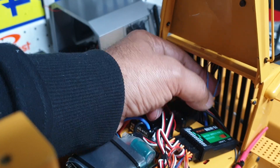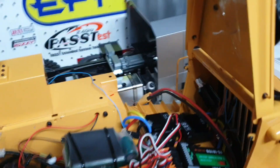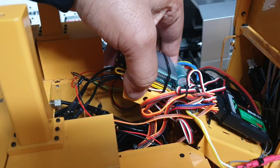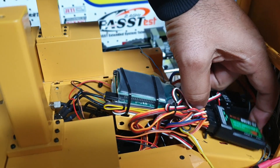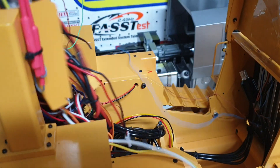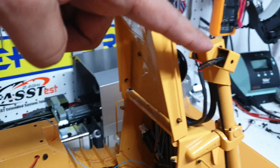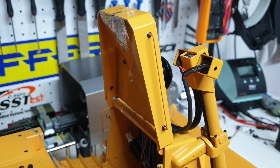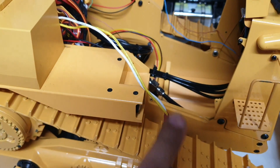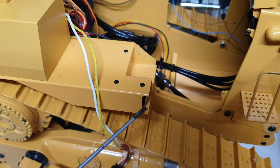You've got the blue wire for the lights up here, and then it's fed all the way to a light switch. The light switch will then be able to independently control four groups of lights. It could be a beacon, which could be group one. You could call these group two. You do have lights underneath the floor pan up here — you could call those group three.